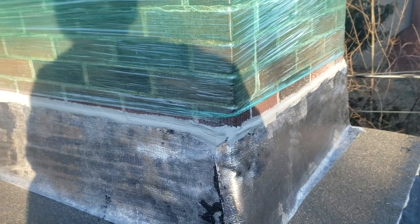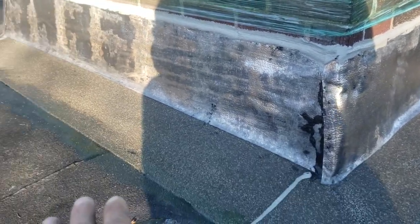We replaced the lead down here. The copper flashing she had before was just cracked and deteriorating and coming away from the chimney. So we got everything 100% watertight on the roof deck. And then going up, we've got two layers underneath this cap sheet here.